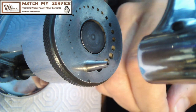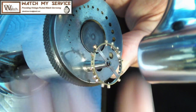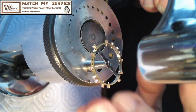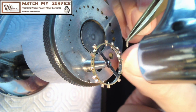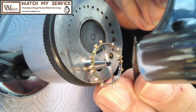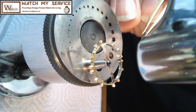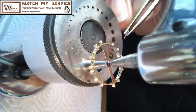If you're going to stake something on you want it to be absolutely centered and flat. If you don't stake it on properly and flat you could end up with the balance being slightly skewed to one direction. There's the hub you can see in the middle of the balance, and that hub is actually attached to the balance permanently. I knocked that out by accident because I didn't know this had a hub on it - I just thought it was a standard balance staff but it wasn't. I position it so I make sure the diameter of the stake in the bottom is the right diameter to allow the hub to rest against the edges of the stake - that way I'm not putting any pressure on the rims or the arms of the balance.